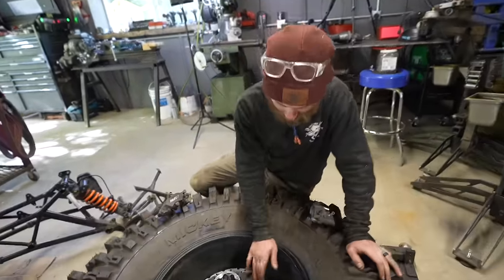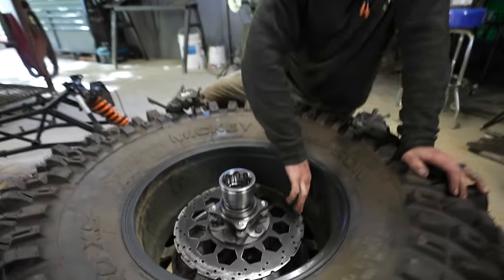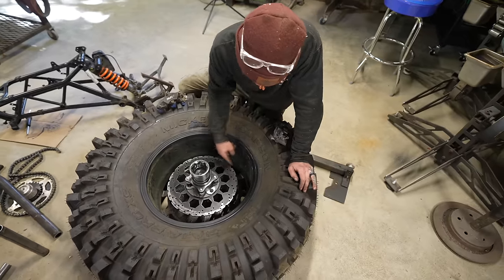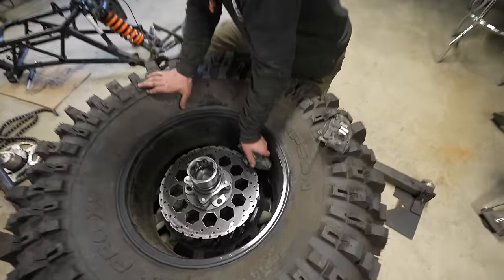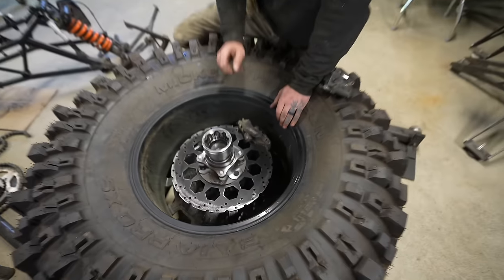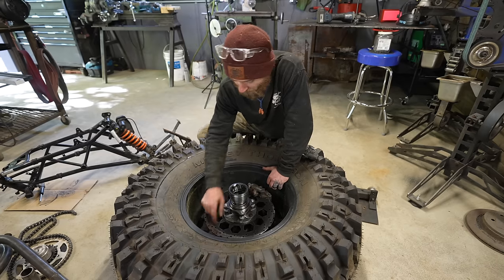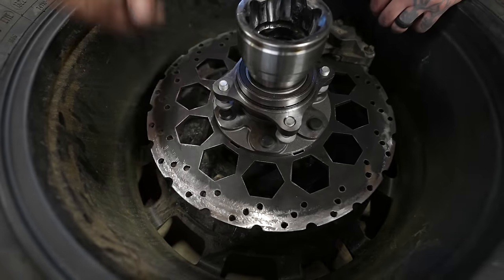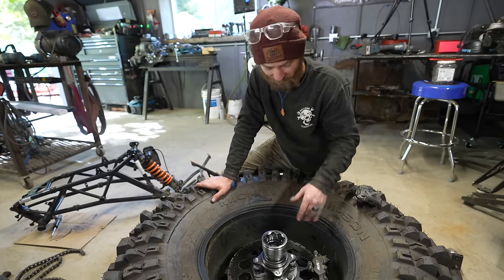How you make a brake rotor with a plasma cutter. I mean, it's pretty self-explanatory, but that turned out rather nice. I put it in the mill because it's too big to fit on the lathe, and I put it on that spinny thing, the dividing head. I spun it around and made sure that the outside is a perfect circle so that when the calipers are on here, they can go on all the way without having chunks that run into it. So anyway, I did that, and then the inside to make it fit on the hub perfectly. And then I tried to make it flat in this direction as well. You can see some of these chunky bits here, but I found that it just vibrated too much because it's pretty thin and it was only gripped in the middle. So I gave up on that, and it doesn't really matter. It's pretty close to flat already. I was just gonna try and make it perfect, but unnecessary.